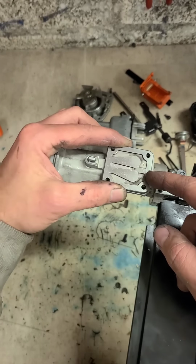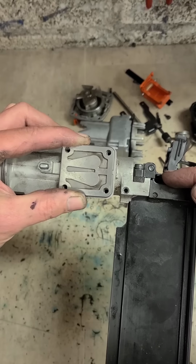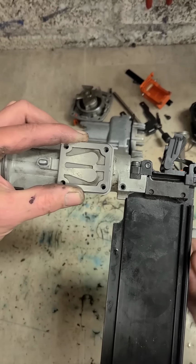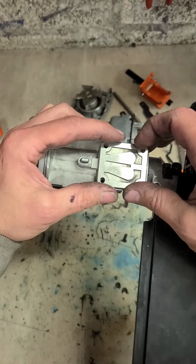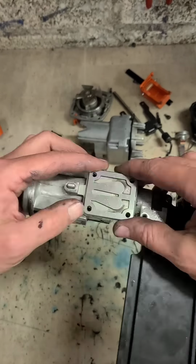It'll be because the firing pin's not going back far enough and allowing the next nail to slide up in front of the pin. She'll still be sticking out and the pins will be underneath it. So if ever that bother, open her up and check that there reed valve. But at least this one now will just be a simple and easy fix.